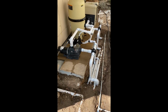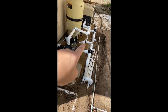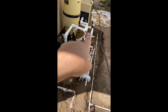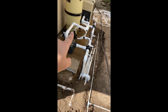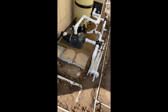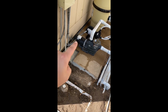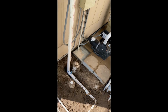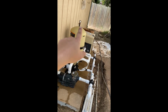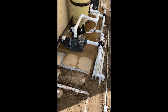Alright, so the plumbing's all holding up. The only thing extra I had to do was plumb the Polaris pump into the return from the T underneath the output of the filter, and then looped it back around. I just used hose that I had left over. I might figure something else different out with that later. Redid all the electrical, put spade terminals on all the connectors inside the casings. Still have to do the ground wire run and connect it to the rod around the corner, but everything back here looks like it's holding up well. It's all good.